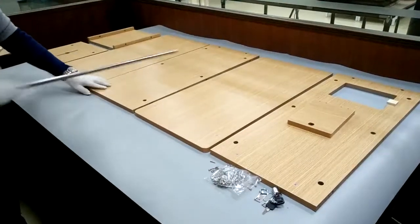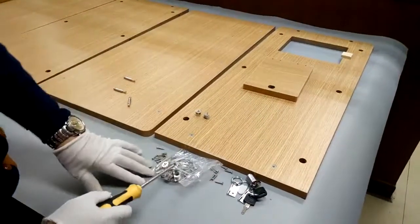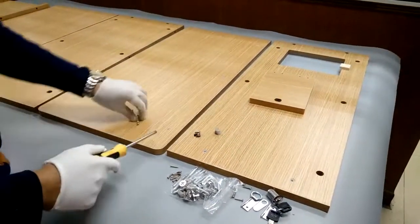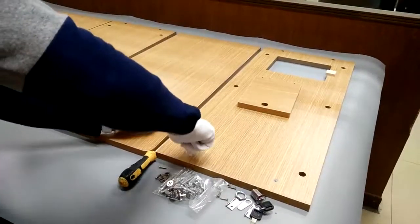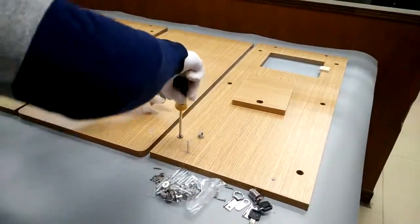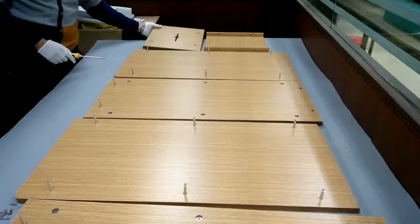For the parts with holes, you want to insert the cams into them and make sure the arrow faces the opening hole. Insert the stems into all the embedded anchors. You can use a light-duty power drill to save time, or a regular screwdriver. Put all the hardware — the cams and the bolts — in one shot to save time down the road.